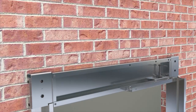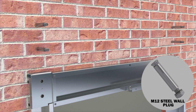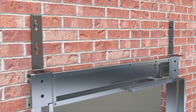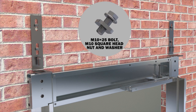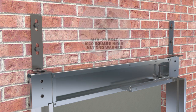The assembly of upper brackets is made at level by metric 12 steel dowels, two in number, mounted to wall at each bracket and supplied by the assembler company. The connection between frame upper rail plate and upper bracket is completed using hexagon head metric 10 x 25 bolt and metric 10 square head nut and washer, with one set at each bracket.